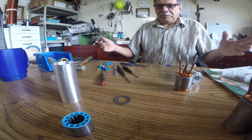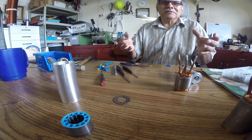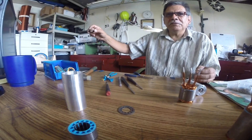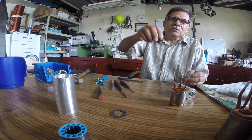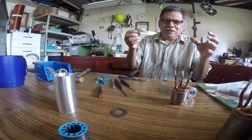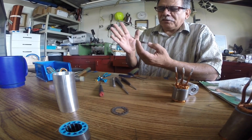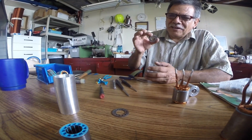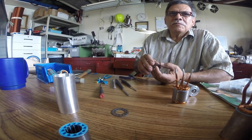It's in a bucket and we put air on it, and it makes a cloud. We heat this at 350 degrees, and then we put it in the cloud. The powder sticks to it — it goes and touches it and starts melting. That's one of the most touchy processes, because you have to know exactly how dense the cloud has to be and how long you have to put it in there.